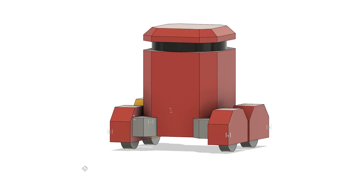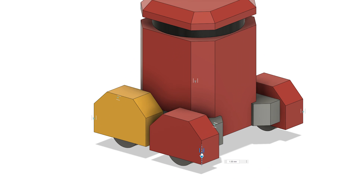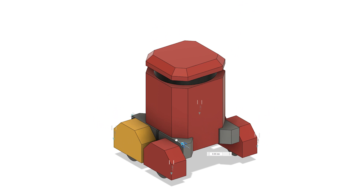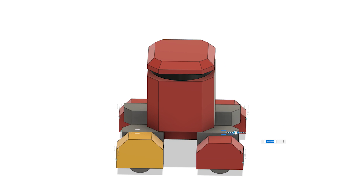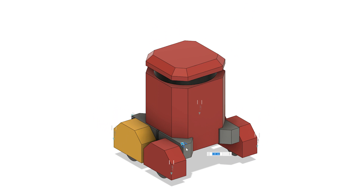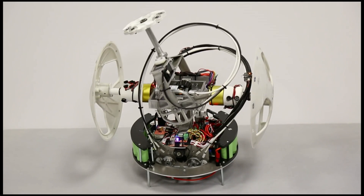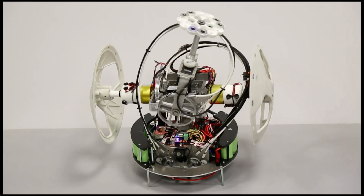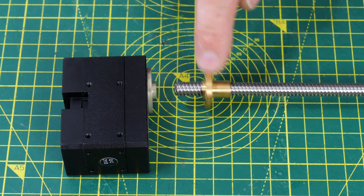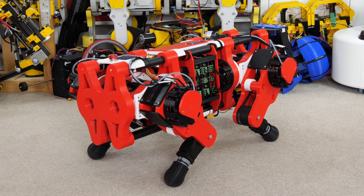So I made a simple CAD model to explore the drive mechanism of the droid. Each foot has a wheel which must have a motor for the mecanum wheels to work properly. Then each foot can slide up and down independently so the droid can lean in any direction or move its whole body up and down — so that's another four motors. The wheelbase can also extend, which is probably another powered axis, although this could be achieved by driving the back and front wheels in opposite directions and using wheel encoders to regulate velocities and positions. Looking at the internals of BB-8 and the size of motors used, I'd guess that some expensive robotic servos are in use in B2 — like the Dynamixels I've used in previous projects. The sliding motions are probably servos in continuous position mode driving lead screws and linear rails. There would also need to be some inverse kinematics to account for the wheelbase length and height of each foot, driving the droid's body to a specific angle in pitch and roll — very similar to my robot dog projects.